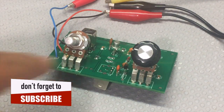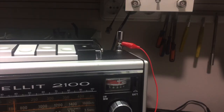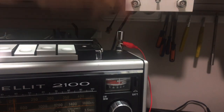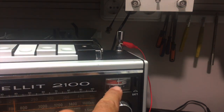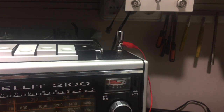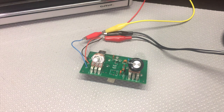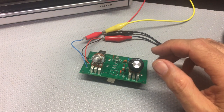I've got this set up now. I've got the supply coming in and the signal output going straight to the antenna. Bear in mind we've got an attenuator there — it's bleeding through enough for the operation, hopefully. I can also see the field strength and I can control it — I can see what strength my signal is coming through and adjust the amplitude accordingly. Let's see if we can pick something up. I've got it on the 40 meter band, around 7-point-something megahertz. I believe there are a few chatterboxes on here.